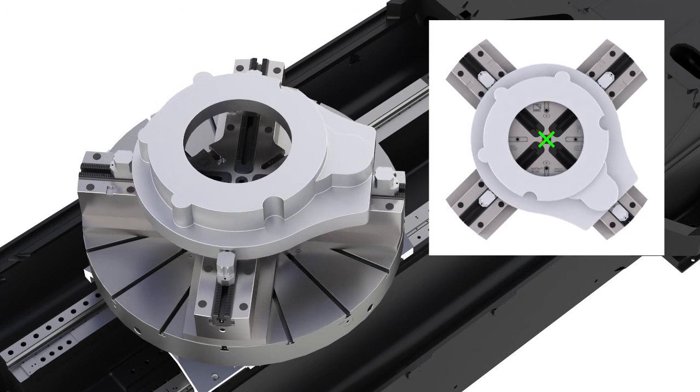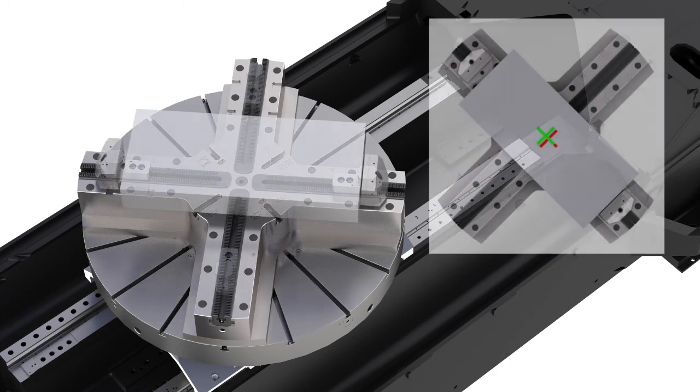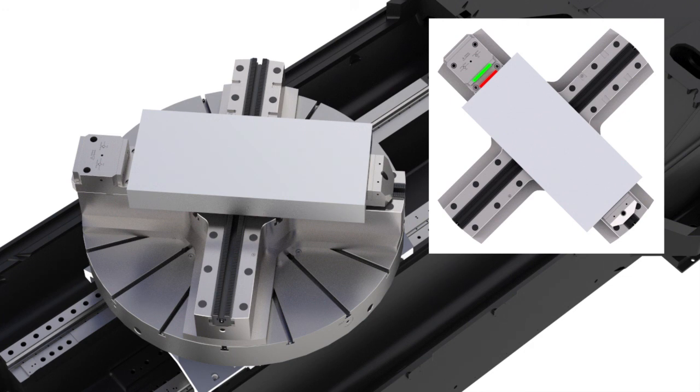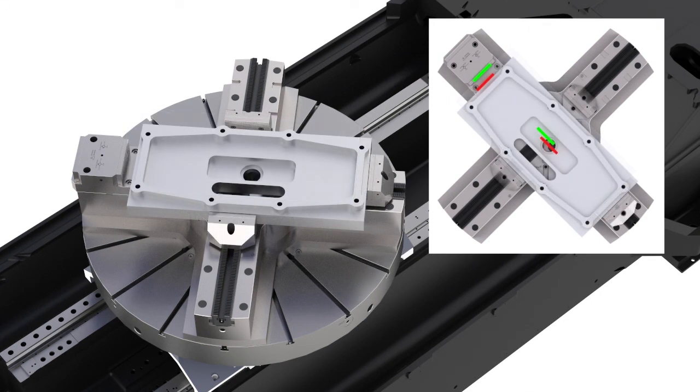The special innovation InoFlex offers, apart from the familiar four-jaw clamping, is the possibility to use the chuck as a centering vise for five-axis machining. Also new is the use of vise clamping with one stationary jaw and one clamping jaw for rear-side machining, for example, where one fixed reference edge is used as you are familiar with from conventional vises.